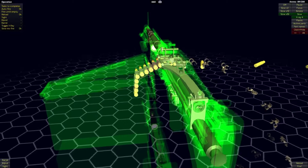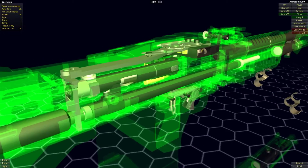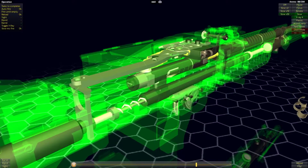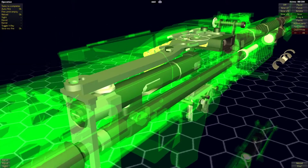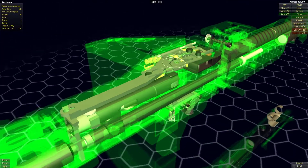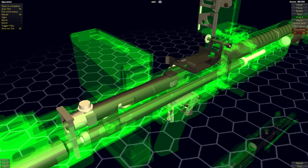So it's sort of hinged on the back here. It's actually operating off of the bolt. As you can see, oh, where's the thing? So there's a thing on the bolt that runs in a sort of track on the arm up there. I don't know if you can see it, that sort of bright thing on the top. So basically, while the bolt is traveling back and forth, because of the curvature of that arm, that stud forces it to move side to side, basically.